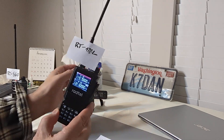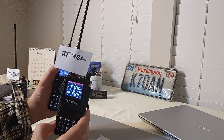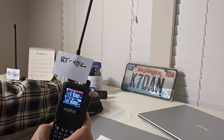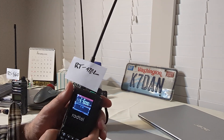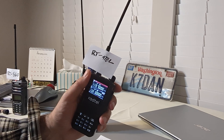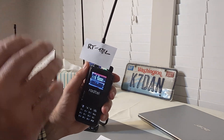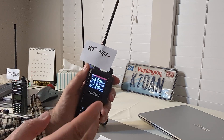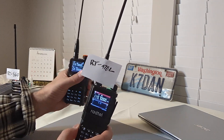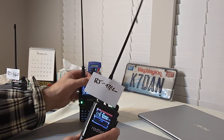I have several other small handhelds like Baofeng, and I've listened to others on YouTube videos playing the airband. One consistent problem with all the other radios I've tried — except this one — is that most of these walkie-talkies, the manufacturers do not implement an AGC. AGC is Automatic Gain Control. It's in almost every receiver made today and for the last many decades. Signals vary between airplanes and controllers — you get different signal levels — and you need a circuit that compensates for this. For some reason, on the Baofengs and many others, they do not have an AGC activated.